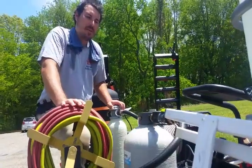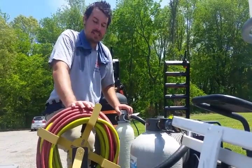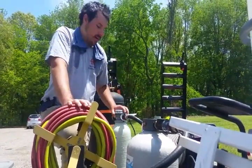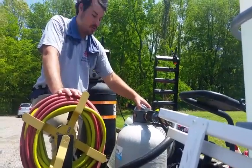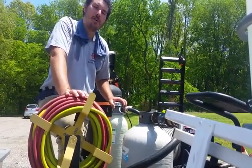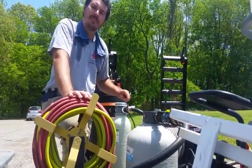And it's not exactly cheap. It just depends on how much you're using it. And then, like I said, if you had a water softener before it, it's going to make it last longer. But I know a lot of people aren't going to do that. This deionization tank, and this is a smaller one, is still supposed to do around 300 gallons. Now that's with the average TDS of around 115 to 130, I believe. So that's another thing. Now I think this one comes with a TDS meter.